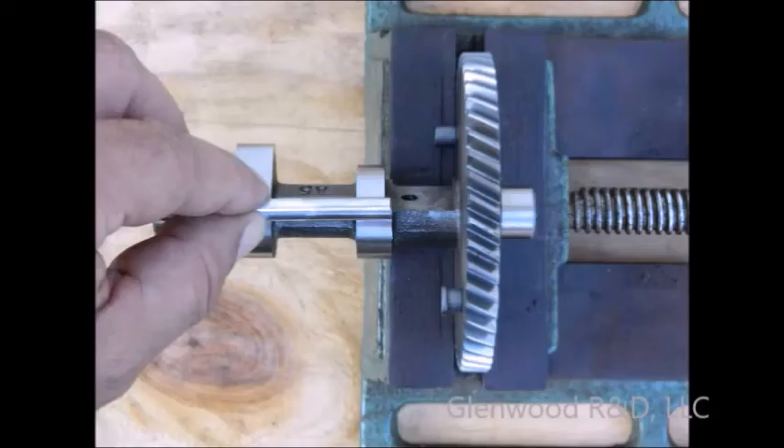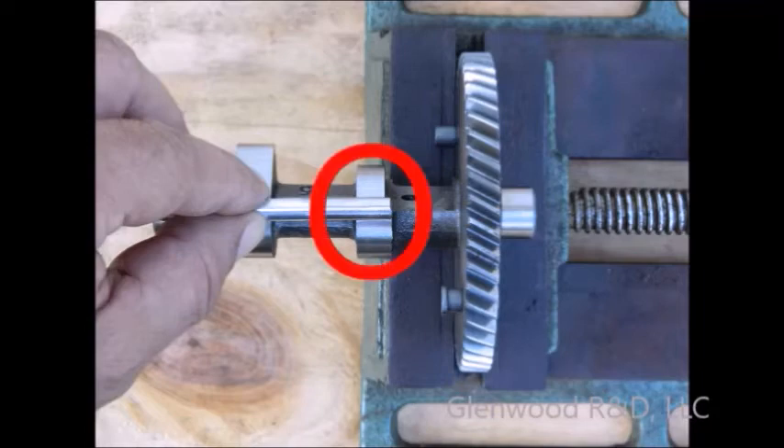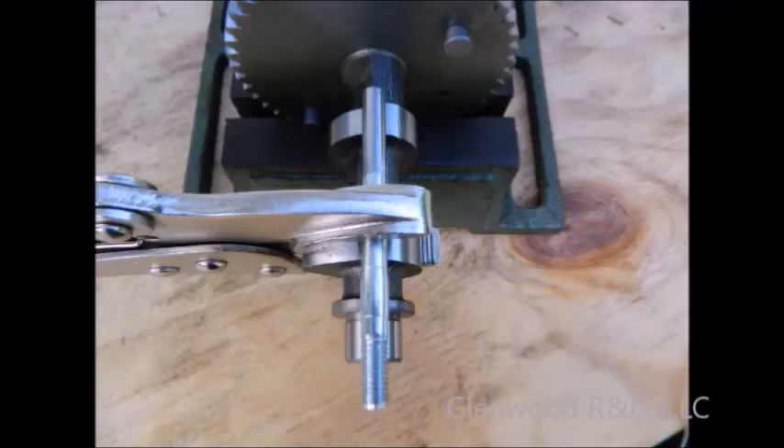Next, place the round stock on top of the cam. Your eye will tell you when it is on top, centered, and aligned straight. Try not to focus on oddities in the shape of the shaft, but instead on the exhaust cam for centering and the end of the camshaft for alignment.